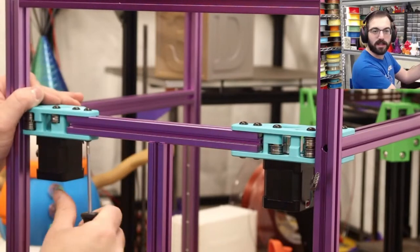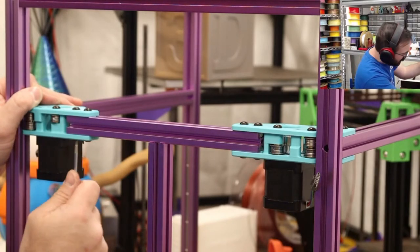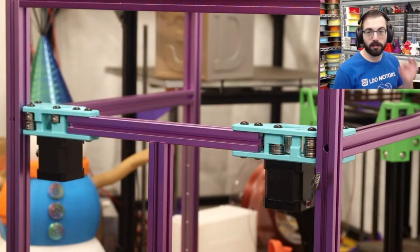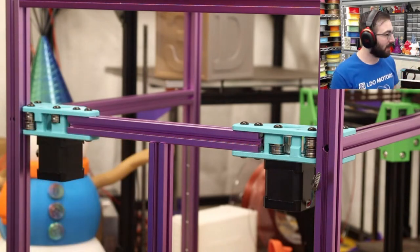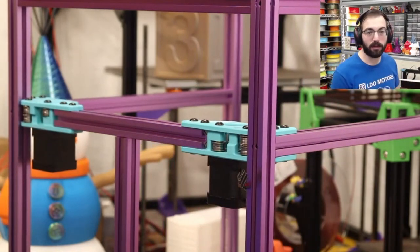You're like, huh, why don't we make this a smaller printer? The concept is really nice, but it's a bit unnecessary for the size of printer. And this Trident's motion system, that's where it's at. With lead screw Z, you don't have to worry about the bed dropping. And then the tri-point leveling. That's perfect for a 3D printer. I don't think you need much more.